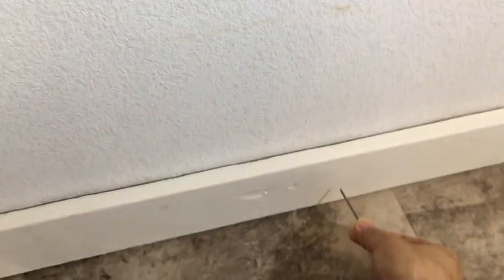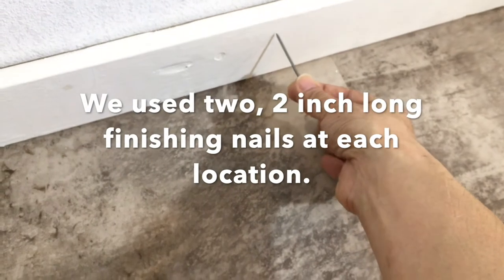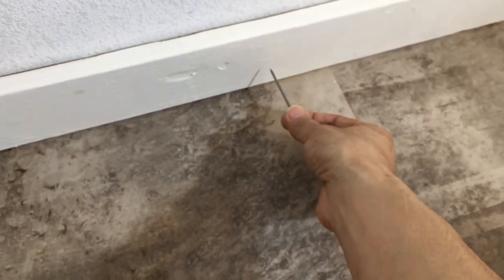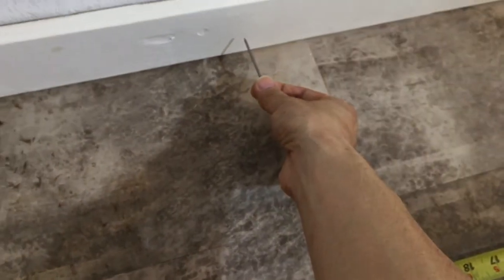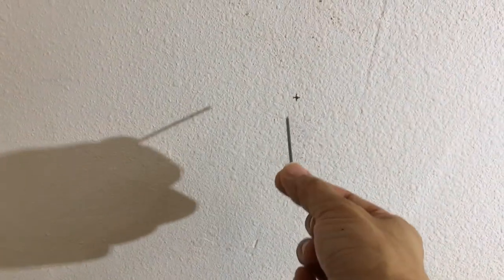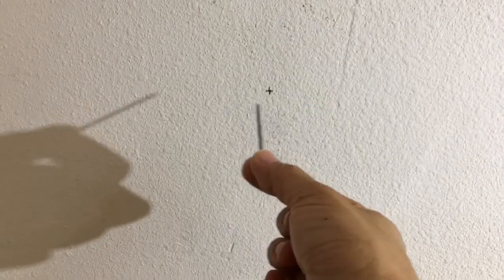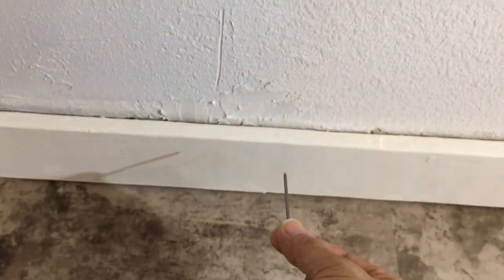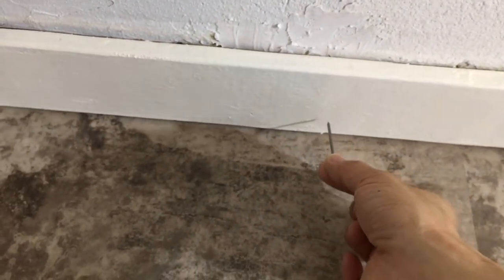and right here. So it would have to be driven through the wood here, maybe two nails over here, and that would go ahead and put this baseboard nailed securely into a stud, so that way it won't loosen up. And same thing for this side here, where this 24 inches was measured. So from here to there, every time there's a mark, it's 24 inches. It goes straight down, and in here, so you just drive your nails right in.